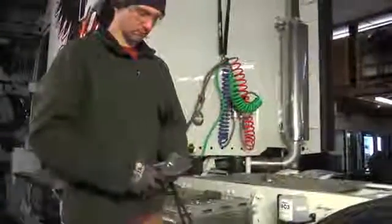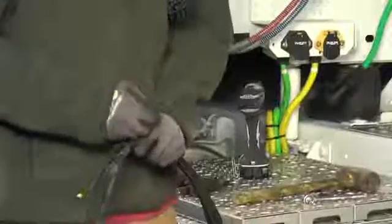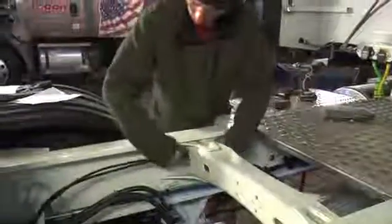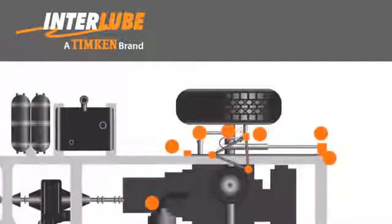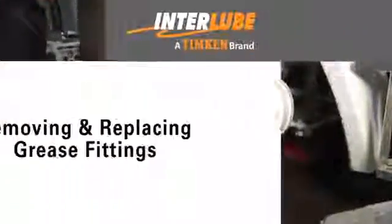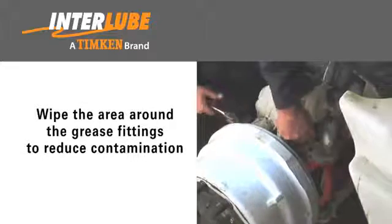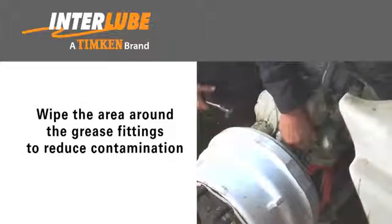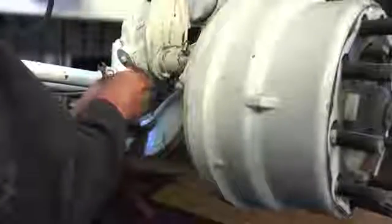The lines will be routed from the pump to the 24 grease points shown in the installation schematic. In this application, 24 lines are grouped into four bundles going to the rear left and right wheels and the front left and right wheels. When installing points on the steering axle, it may be helpful to remove the tires for easier access to the grease fittings. To reduce grease contamination, wipe the area around the grease fittings before removing. The appropriate grease fittings will be replaced with the tube fittings supplied in the kit.